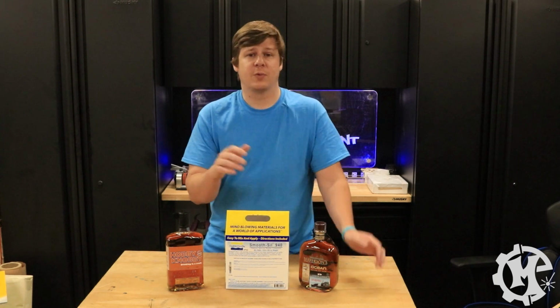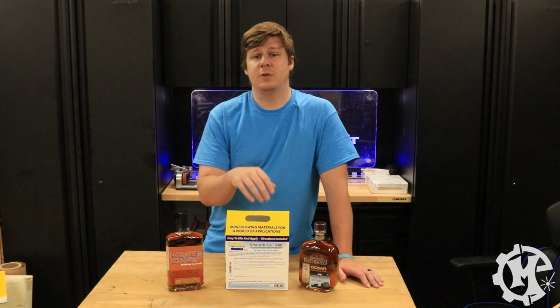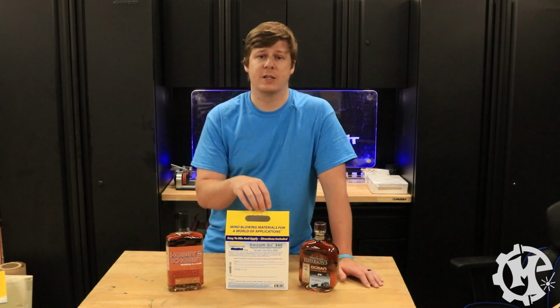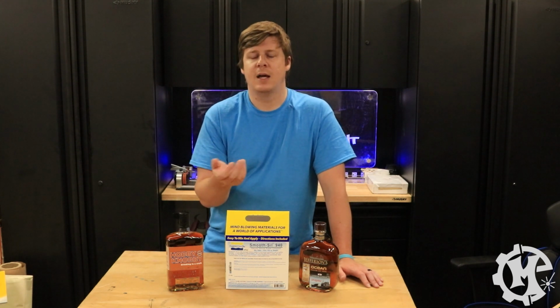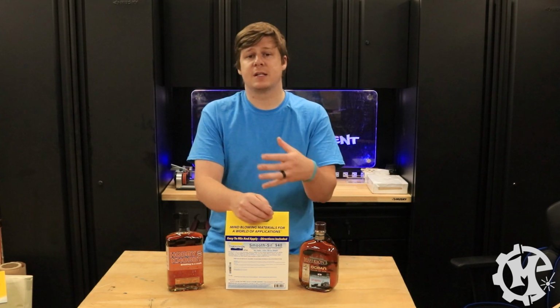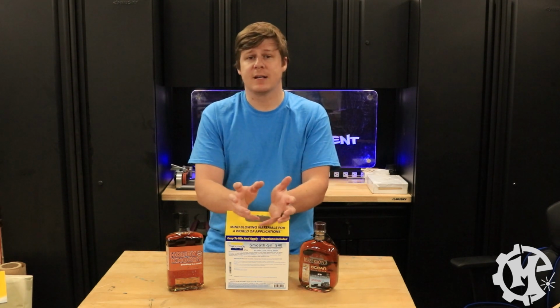So I've never actually worked with silicone before. This is going to be a brand new thing for me. And for this project, I'm going to be using Smooth Sil 940, which is a food grade silicone. So that means that I can use it for ice cubes or chocolate or pretty much anything that is going to be considered edible. So the first step to this is going to be laser cutting out the ice cube designs, and then I'm going to make a mold out of that design.